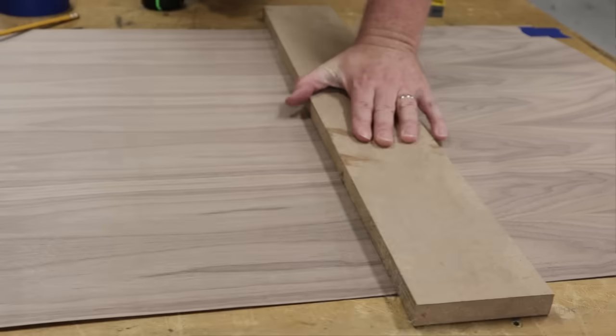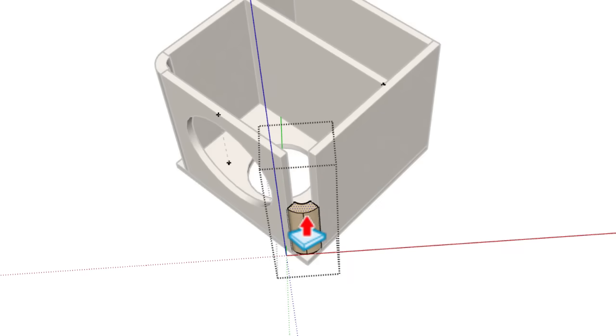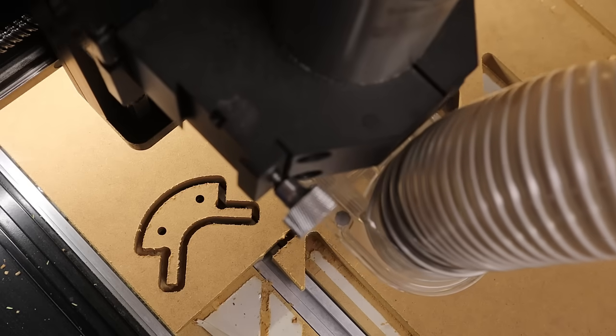The goal is to cover the front and the sides with one big, long sheet of veneer. But veneer doesn't bend well around tight corners. To solve that problem, you need curves. There are a lot of ways you can do curves — you can use a massive round-over bit, or there's a method called kerfing where you remove material to make bendable MDF. I'm going to try something I've never done before, something called StackFab. For that you're going to need, at the very least, a router. I happen to have a CNC machine, which makes cutting curves stupid easy, so let's give it a try.